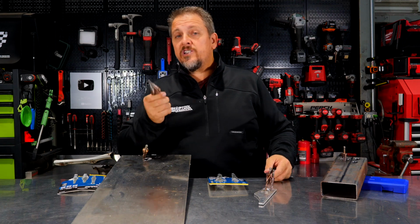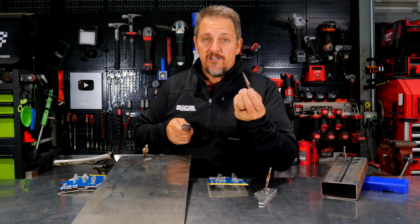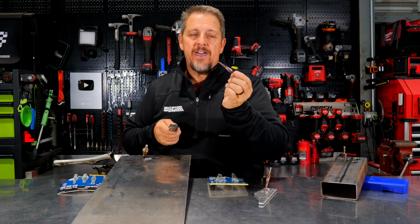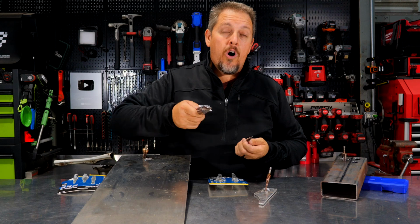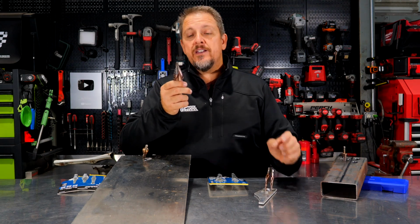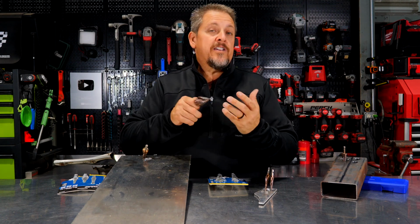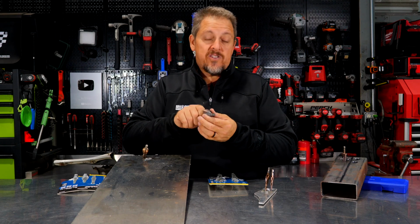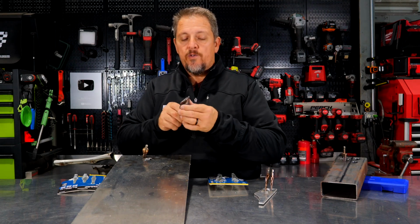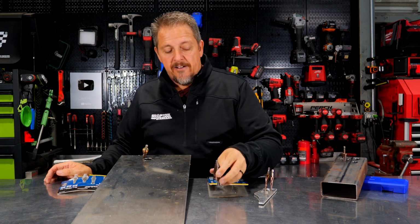Again, sheet metal, just understand that it is a very aggressive set and that you'll want to go to the finer steps, and that'll ease up that wanting to kind of grab and walk it on through. So just be very careful when you're using an aggressive bit with the large steps when you're going into thinner sheet metal. It will want to distort that or make those jagged edges and pull that bit in there, so be careful with that. But still a great price on these, so check them out from Harbor Freight.